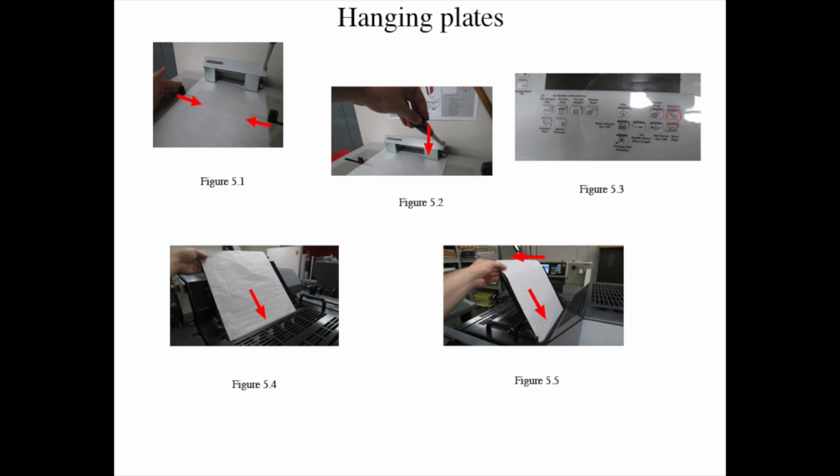Step 4, then press autoplate, figure 5.3, and wait for the 3 clicks, and then move the plate selector facing feeder side and then put the light color plate facing the ink fountain / feeder unit side, figure 5.4. Then press autoplate again, figure 5.3, to put it in the press. Then repeat the process again with a darker plate.